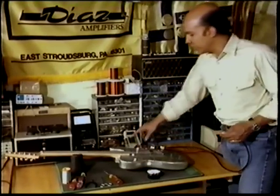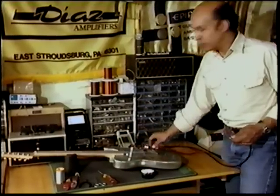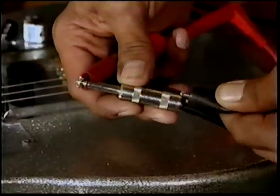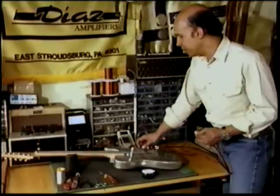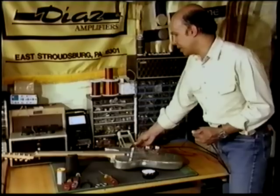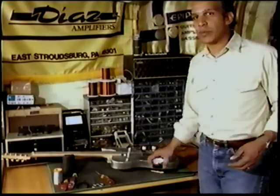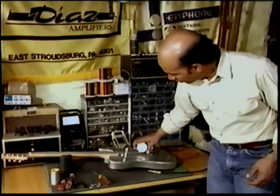So we'll put it on the 20,000 ohm scale, which is the nearest scale to 6,000 ohms, which most pickups are. So we'll take it from 0 to 20,000 ohm and see what we have. Rhythm pickup reads 5,200 ohms. Lead pickup reads 7,420. That's very natural. The pickups read, that means that the problem is not in the pickup, so it's probably in the strength of the magnets. So we'll use the Gauss meter for this problem.